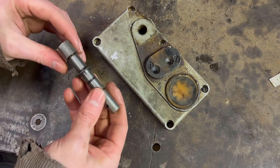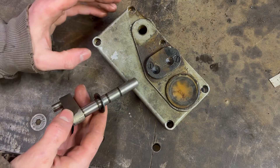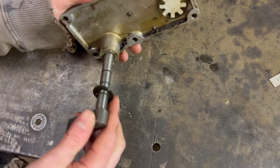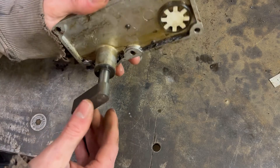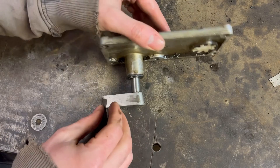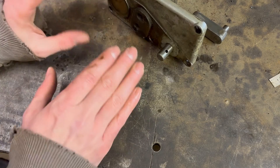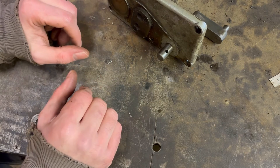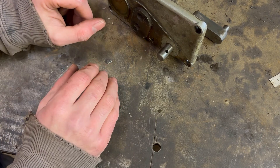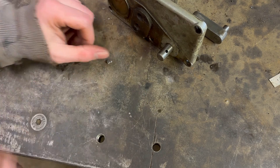So that's that then - two o-rings fitted on there, so that's a lot better now. Probably not twice the sealing capacity but probably 50% better than it was. So we can fit this back together, and that should be a better seal for a little bit longer, less chance of that leaking anyway. So we can refit that to the drill, build the drill up, job's a good one. Hope you've enjoyed that, just a quick one today - nice little modification for an earlier 2GS or 2G if you've got one. Thanks for watching, see you next time.